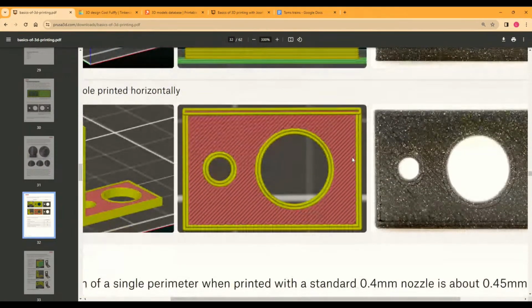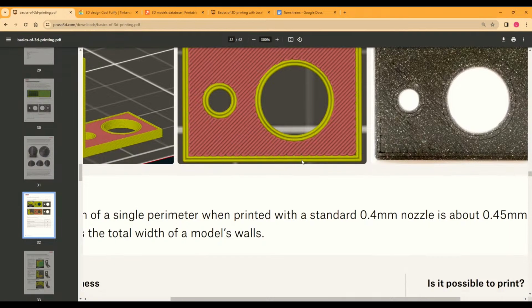But the slicer will control the difference, like how the travel paths of the nozzle go. For the FFF or FDM printers, it'll tell it how to move and travel to fill in all these gaps. But when it comes to resin prints, it'll do the same thing, but it'll mask the light. If you think of a resin print, this whole thing would be one solid object, no lines. It's not drawing each one of these extrusions like the FDM is. And so they'll use the same type of file, the model itself. It's just that the slicer will distinguish how to bring that file to life with the type of machine that you're using. That makes sense.